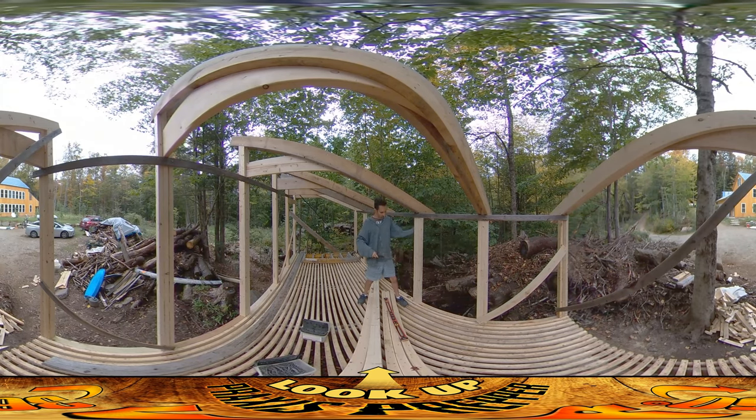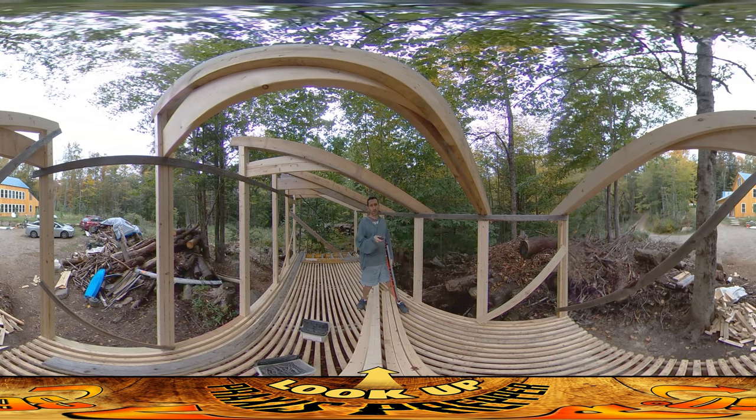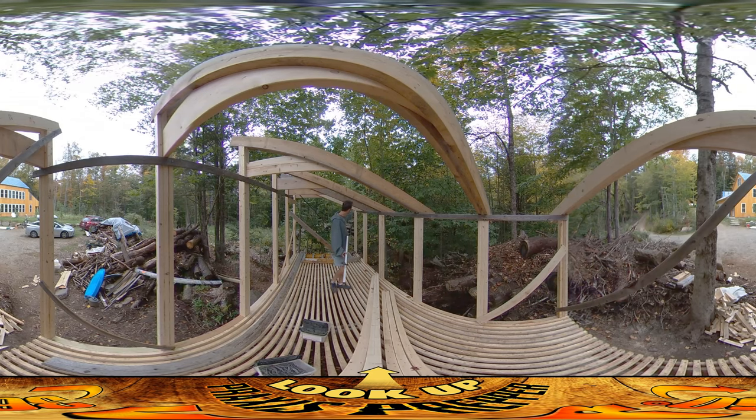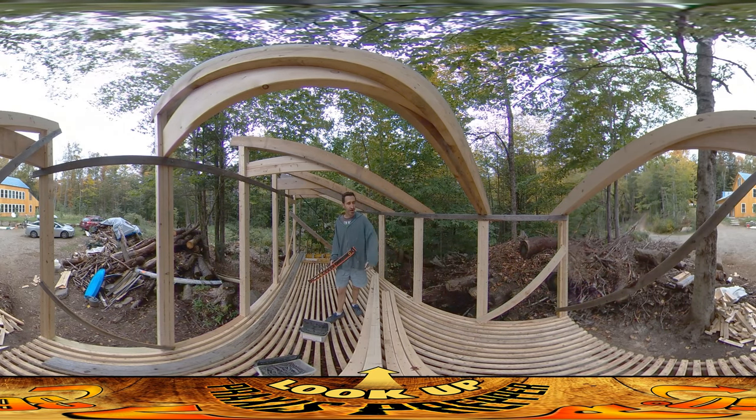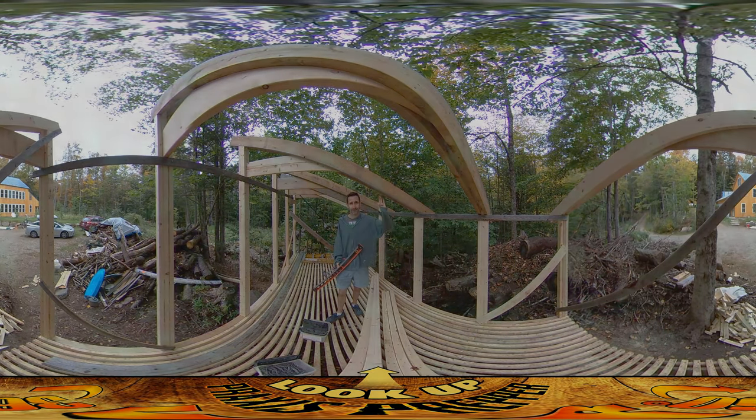Okay, so now at this point I'll pull this one back out so this post is free to move and I can set it level. You do them one at a time. This board doesn't reach all the way to the back one, but once I get this guy set I will put another board under here — it'll extend to there — and then grab that one. At that point everything is braced out and I can start with my sheathing. That's it, thanks for watching.